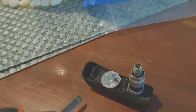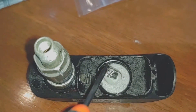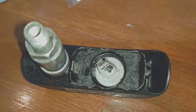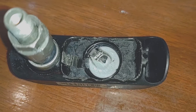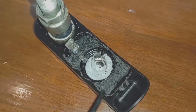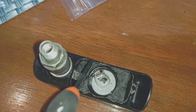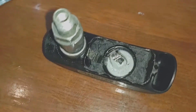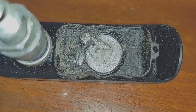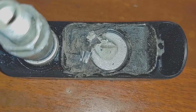I'm working on getting this other one out and I'll do the same operation as I did at the back. Negative tab down at the bottom, positive tab at the top. Be very careful as you're taking these apart — don't get overconfident, because you don't want to do any damage to the board underneath. You can see where the battery fit when they poured in the acrylic. I'm going to remove a lot of that so the battery holder can set in there. After uncovering the tabs, I've cut them off so I can solder the wire to the tabs and they won't come in contact with each other once everything is put back together.